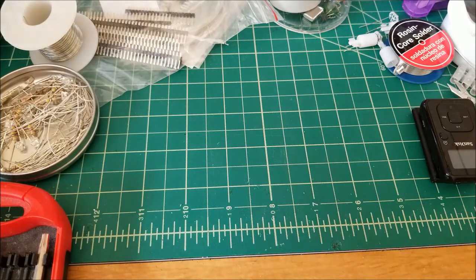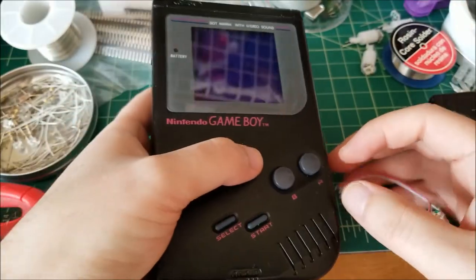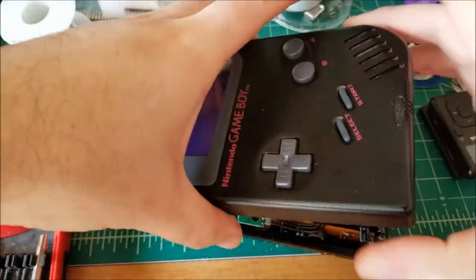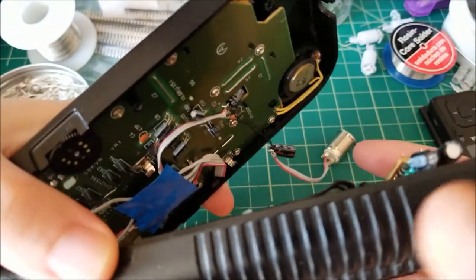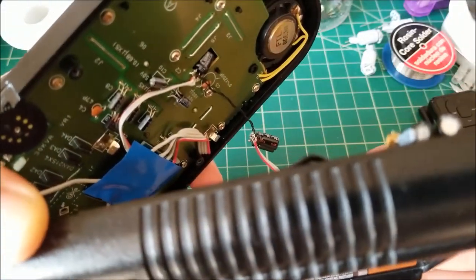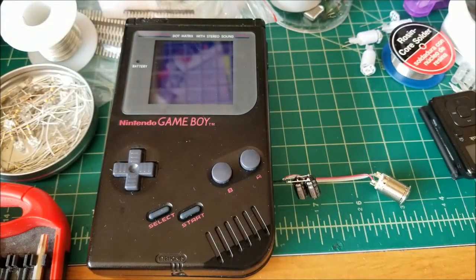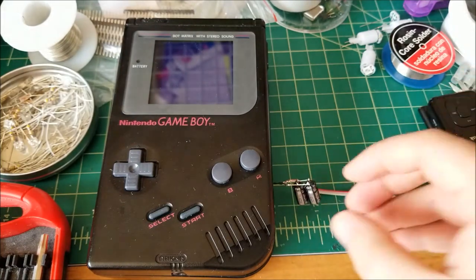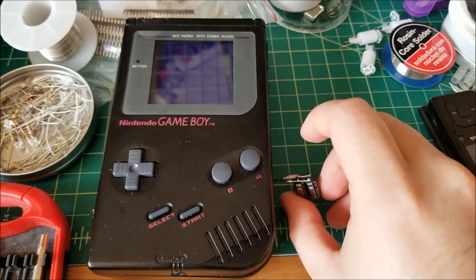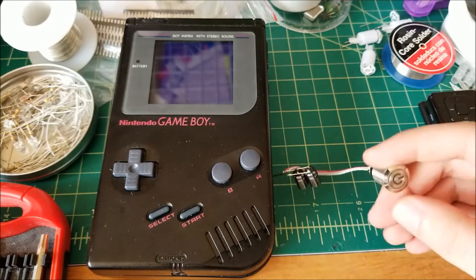The last unit I wanted to test would be my test case, so both of those are the standards I'm comparing it to. This is a black Play It Loud. I've biverted it and RGB modded it with my RGB controller chip. If I carefully flip this over, you can see I've tacked on two extra wires onto the five-volt rail that I'm drawing current from for my RGB chip. I've hooked those up in parallel with two extra capacitors — around 330 microfarads each, so a total of about 630 to 660 microfarads of capacitance — with a series switch so I can turn this on and off at will just by pressing this little switch.